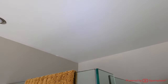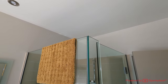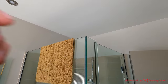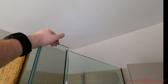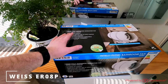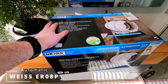Considering this timber and other things above the plasterboard ceiling - if you're unsure about where to locate bathroom fans, ideally you want to go somewhere between the shower and the bath. If there's just a shower, anywhere inside the shower cubicle works. Generally we like to put them towards the corner of the shower as it makes a discrete location. Otherwise, if it's towards the center and the downlights are already in, you may want to center it to the downlights. These fans sense the moisture level in the air; when it detects moisture it sucks the air out, and if there's an increase in steam it'll ramp the speed up to compensate.